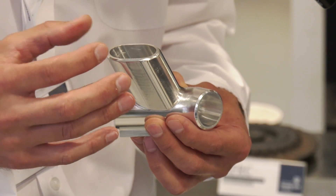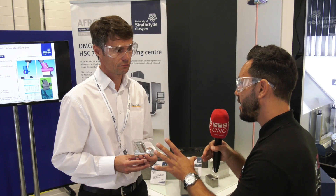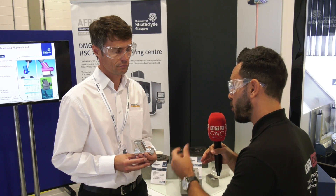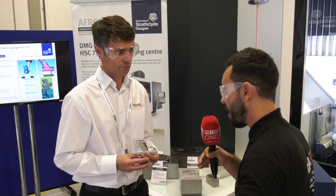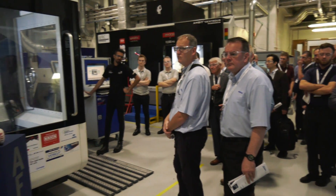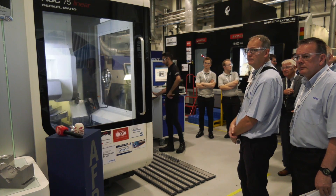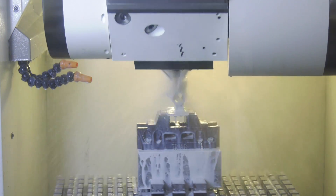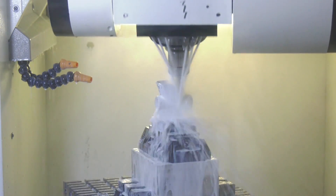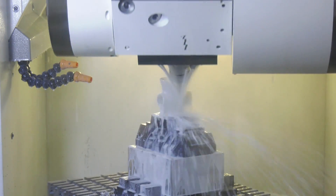With the tool and tool holder we're within a millimetre of the part. We're showcasing different cutting strategies — conical barrel cutting on this particular part, as well as lollipop cutting to get that nice internal blend. Are these new strategies to the Scottish marketplace? I think it could be, based on the interest and feedback we've been getting here.